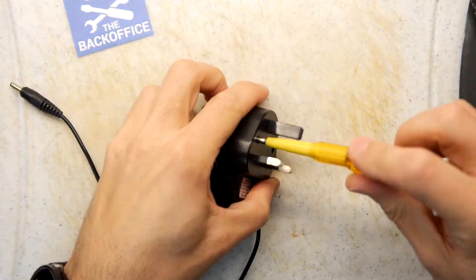I'm wondering, because it was a cheap and nasty USB hub, it may well be that this has died for whatever reason and caused this thing to short. Maybe the transformer's got a short in it. And when this was plugged into the hub, it might have been shorting out the PC's USB power, because they might not have any protection diodes or anything like that. So plop that in and it would have killed it.